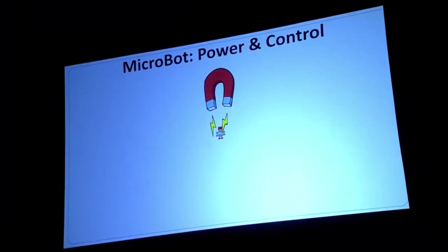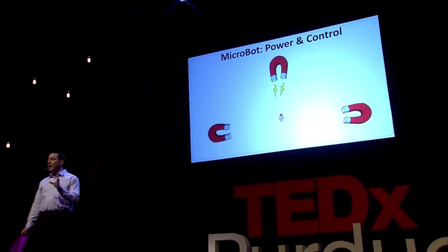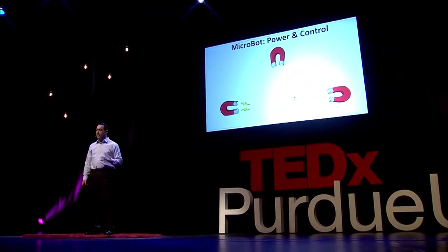So what are we going to do? One thing we can think about is giving this robot a little hat — we can make it magnetic. If we stick a magnet in its workspace, it's going to be attracted to that magnet. That's the approach we take here, except we use special magnets called electromagnets, so we can turn these on and off whenever we want to. We can surround the workspace of the robot with these electromagnets and control it to move in the plane.